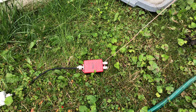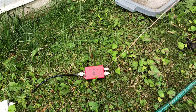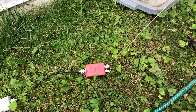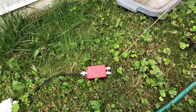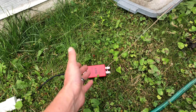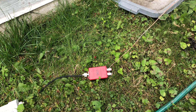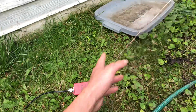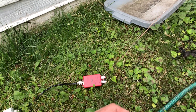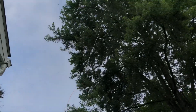So far at 39 feet, I thought it was working on 80/75 meters but haven't been able to make a contact on it yet. It's too short for 75 meters — half-wave on 75 is roughly 126 to 133 feet. To find your half-wave you take 468 divided by the center frequency; for example, 3.900 MHz. With a random wire, you don't want to land on that exact number — you want to be above or below it.